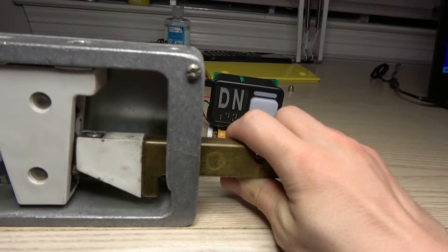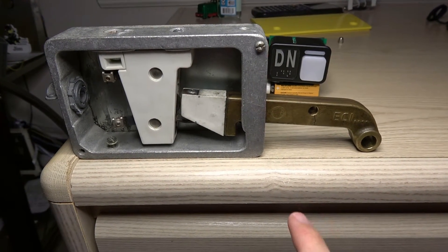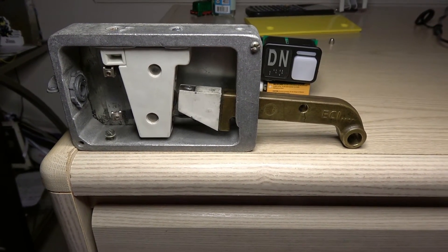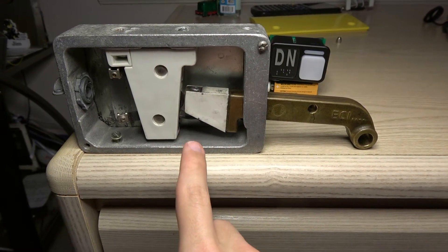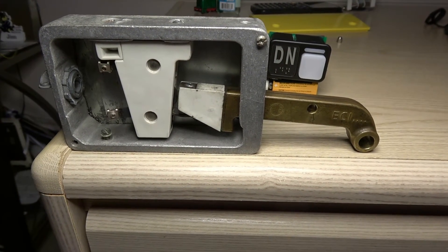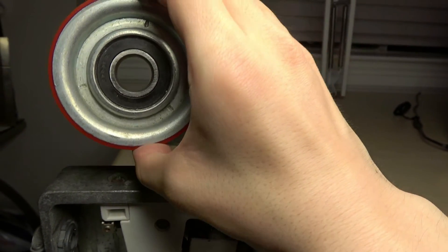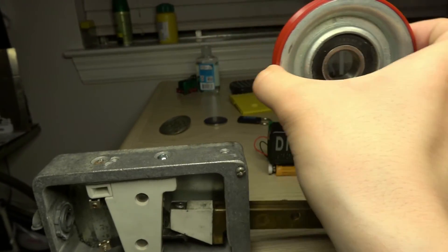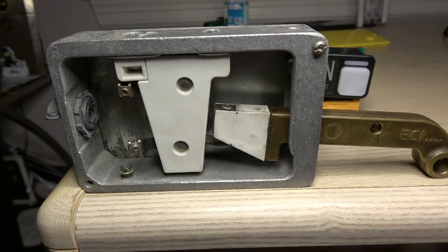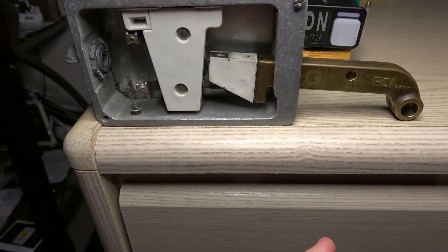To close it — now it's shut. Do keep this in mind: try not to let the door slam because, for one, it'll probably cause damage to the door interlock device, and two, people from outside the elevator hallway can probably hear it and may get startled. The thing about spring-loaded hoistway doors is that they have a roller above the interlock on a track held by a rubber strap — that is what makes the hoistway door spring-loaded. Close it gently because some spring-loaded doors can slam really easily.